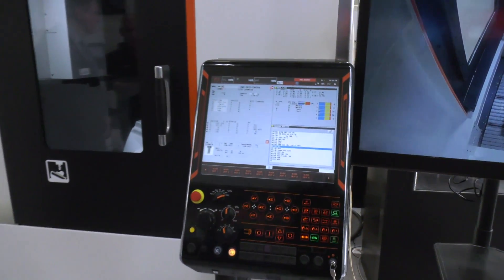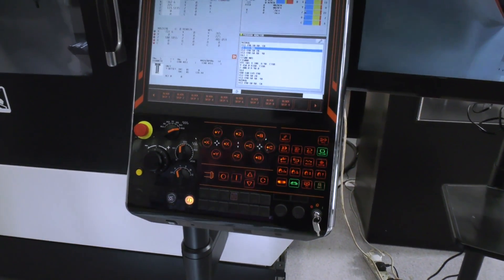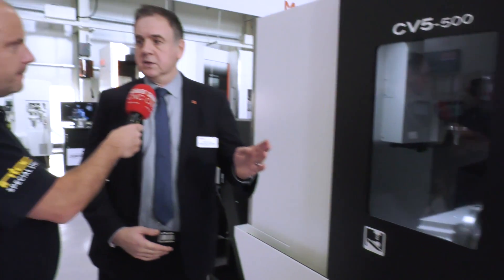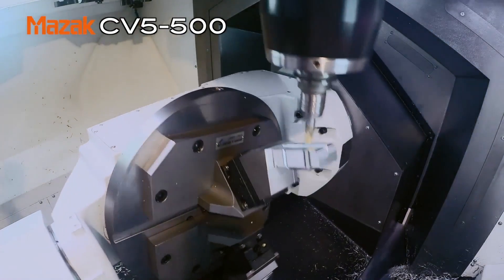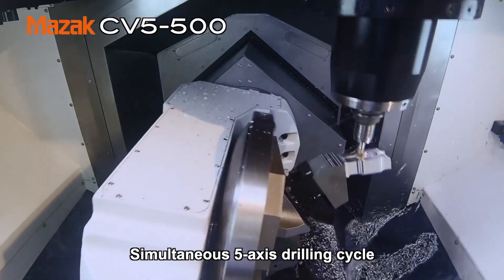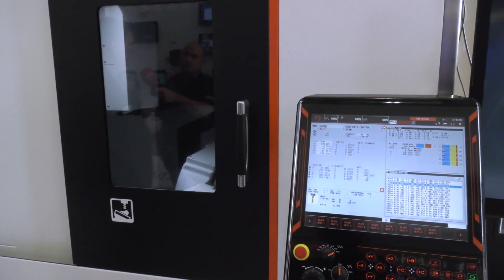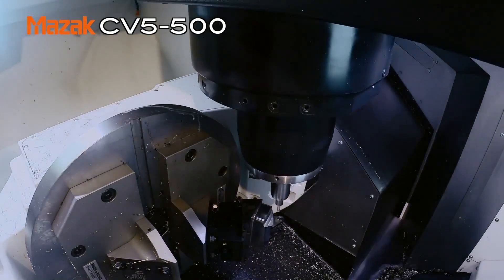You've certainly been doing this a long time, hence having your own control. With the Smooth control and five-axis machining — looking at the best surface finishes and accuracies on parts — you need fast processing speeds and good look-ahead. The control is class-leading; its five-axis performance is really phenomenal. We've done a number of test series and some results have been quite staggering in terms of reduced cycle time. The processing speed and advanced software make a huge difference with handling data and the quality of surface finish you obtain from the machine.